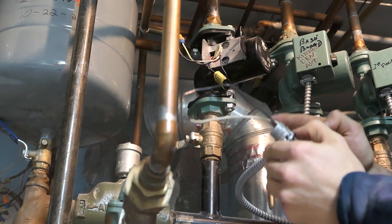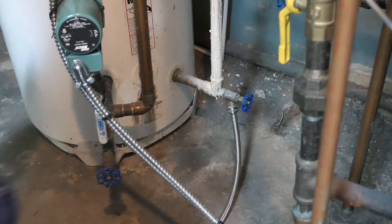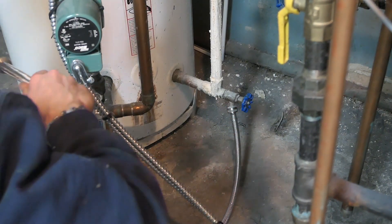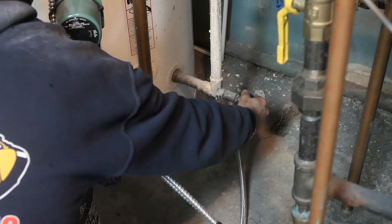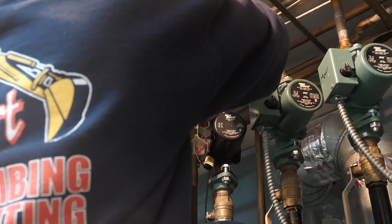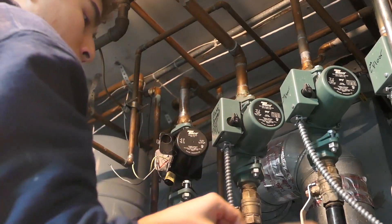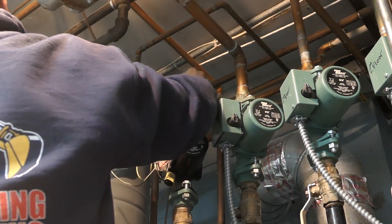When I came back to check out why the man had no more hot water after I replaced the expansion tank and relief valve, this pump was burning hot. But the pipes right after that circulator pump heating the indirect tank were not burning hot. That's honestly how I knew 100% that the circulator was bad.